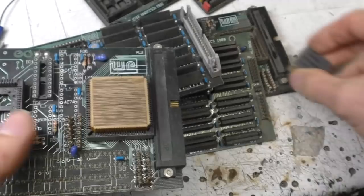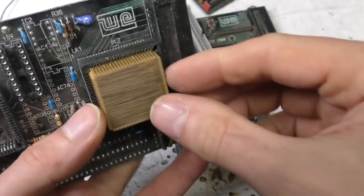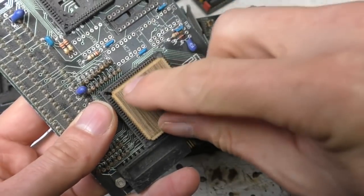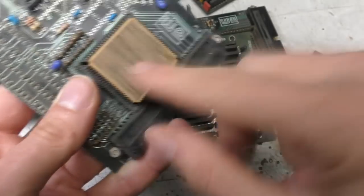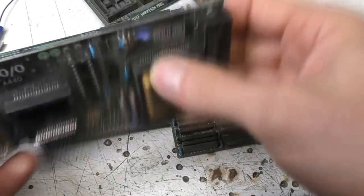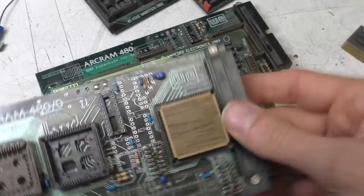Later on, the guy that ran one of the other companies in the Archimedes peripheral business, his father was an engineer, and he made some special tooling to take the standard SRBP PCB material, simultaneously cut the tracks to the right depth and then glue them around these blocks. So those were a bit cheaper. Again, I don't quite know the point at which we changed over from using these. At that time I wasn't really involved in the manufacturing side of things. Watford Electronics handled that themselves.